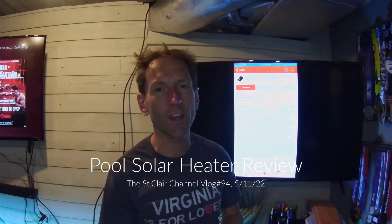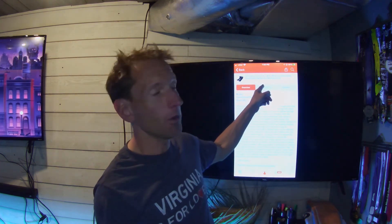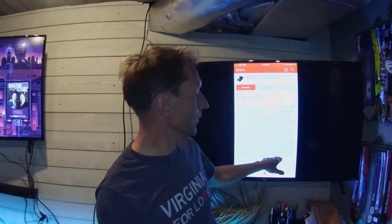In this video I am going to give you a recommendation on pool solar heaters. Should you buy one? I don't know — I'm up in the air here. You'll be the judge; I'll show you what I learned. I'm almost leaning towards no. The one I bought is called Extreme Power. I bought it from Home Depot. I purchased four 4-foot by 20-foot panels and it says it raises the temperature up to 6 to 10 degrees, and I'd say it's as advertised. So let's go ahead and do the research and show you some tests.